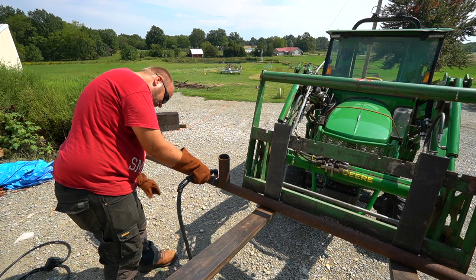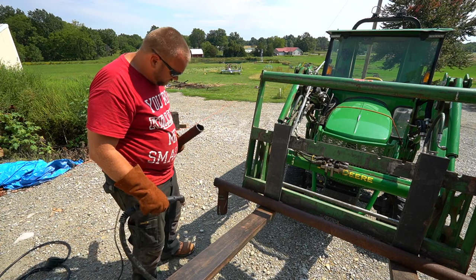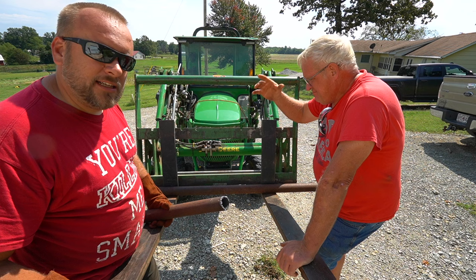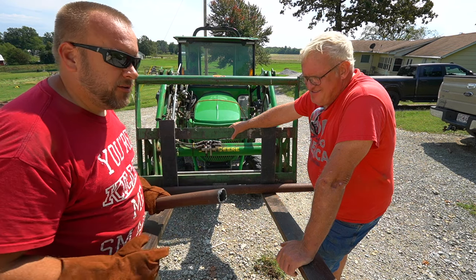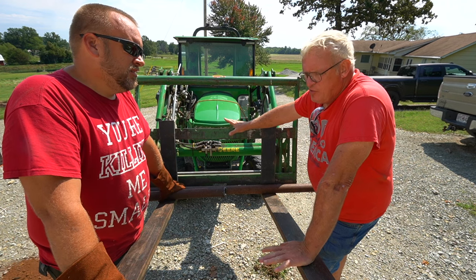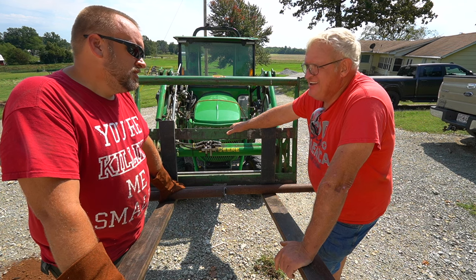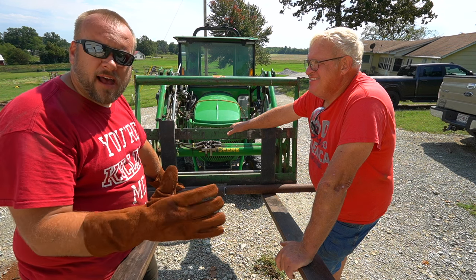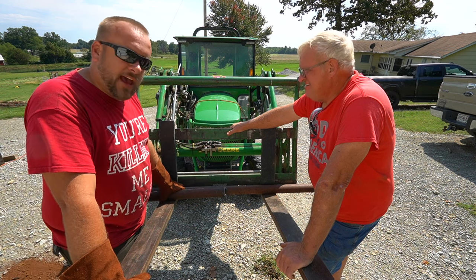The plasma cutter was slow on the pipe and we didn't even try it on the steel rod because it's just not rated to cut anything that thick. There's definitely a learning curve to cutting thin metal from the side — it felt pretty easy to use but I had a little trouble being able to tell when I was getting all the way through the pipe, and I made a nasty, ugly cut. It will do it, but it's not the right tool for cutting this pipe. If you're used to using one you could probably cut quicker and easier with a plasma cutter than most anything else, but unless your hands are extremely steady you don't get a straight cut. On a flat surface on a work table you can use a guide — it's got a little guide on the tip — but freehand I had a hard time.